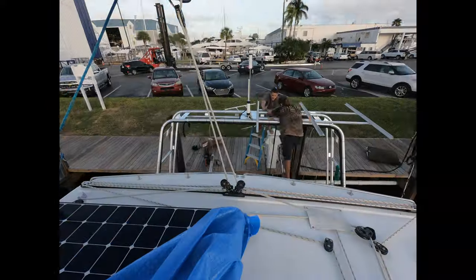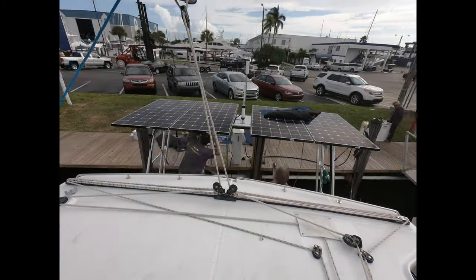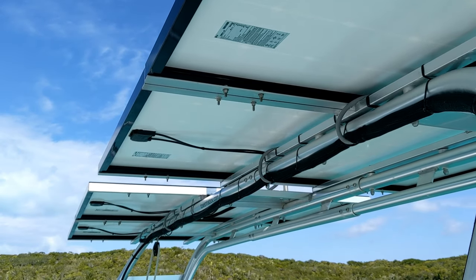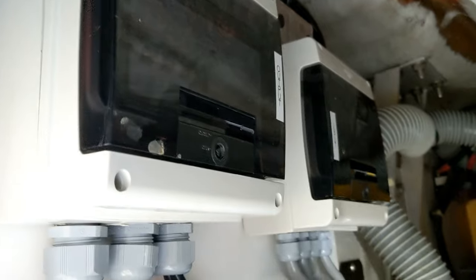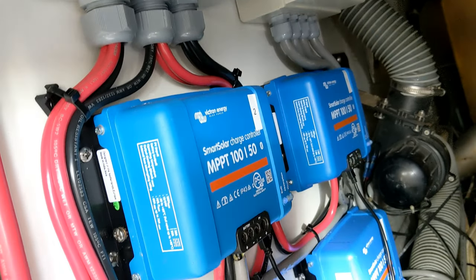I had to have some brackets made. I have some pretty hard and fast beliefs for how solar panels should be installed. My system is pretty simple, but more complex than most in the fact that each panel is in parallel. Each panel goes to a breaker, then to the solar controller, then to another breaker, and from there into a bus bar to the batteries. Each solar panel can be pulled out of the system with the breaker in case there's a problem.